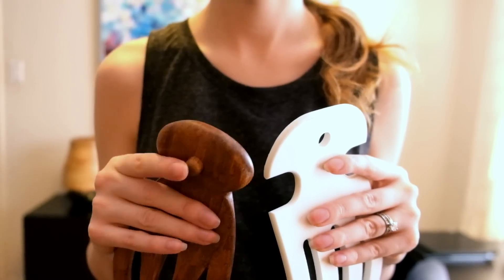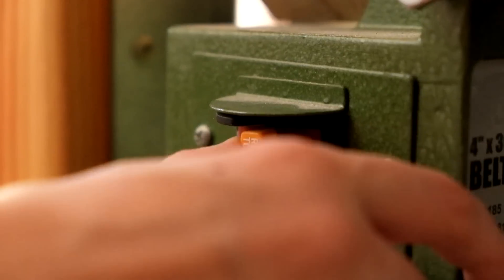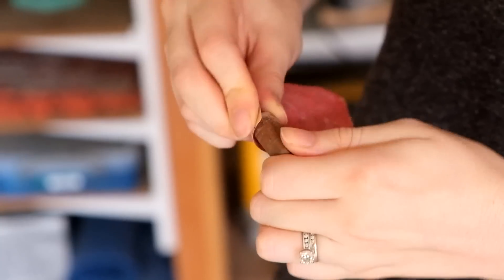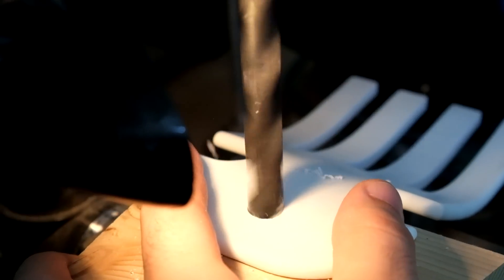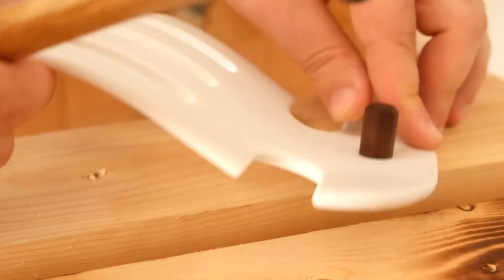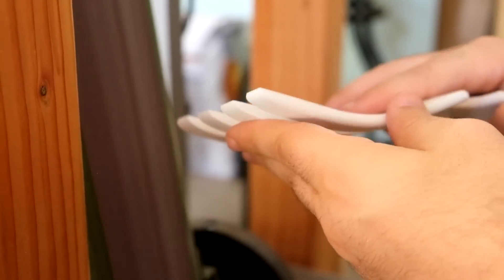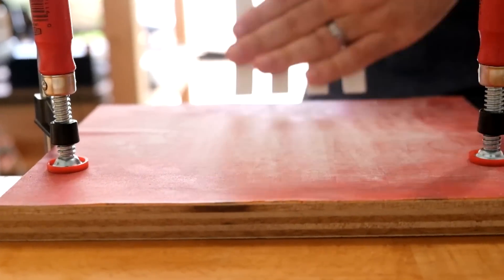Now that the form of these is right, we're gonna do a couple things. We're gonna add a taper on the end so that it can scoop better, and we're also gonna add a dowel right here so that it doesn't fall into the bowl. We rounded over the ends of our dowels on the belt sander and finished them by hand. To get the hole to its final size we drilled only part way down from each side to prevent any chipping when the drill bit exits. We very carefully tapered the ends on the belt sander, then hand sanded everything to achieve the proper surface finish.